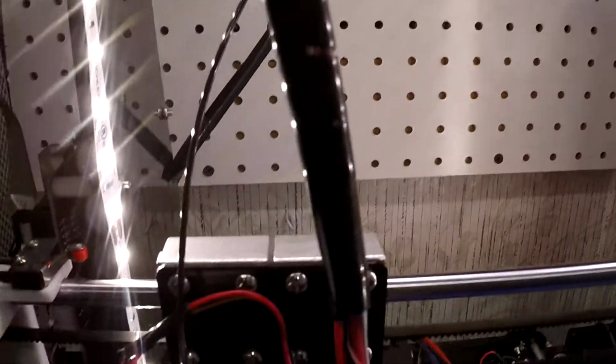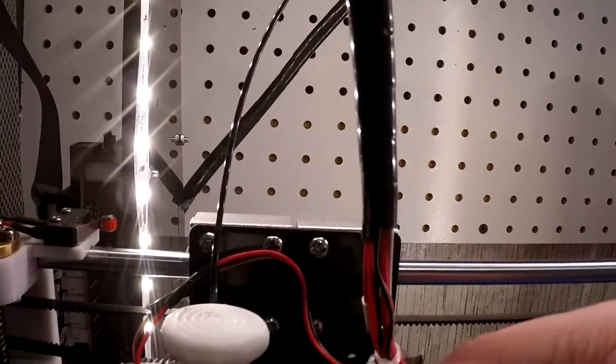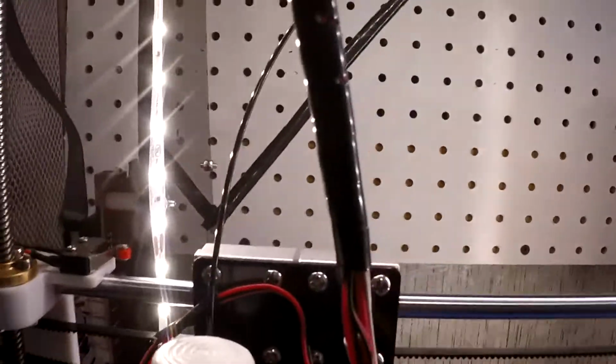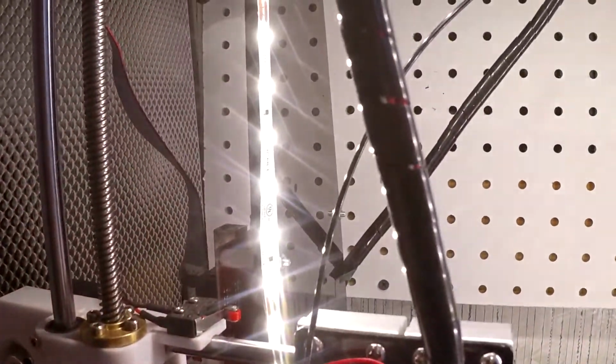And when you tighten screws down, your preventive maintenance is what I call it, you want to give them all a turn. And this is your number one problem too. Never push down on this or whatever. And when you're doing the filament, I put my hand here and then do this, and that way when I'm pushing down, I just compress my fingers. I don't push down on the extruder, because that will throw out your Z's. Okay.